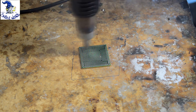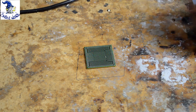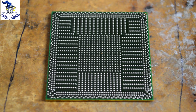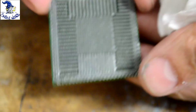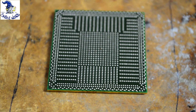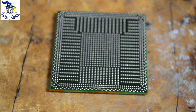The chip is now ready to be soldered back to the mainboard. As you can see, all the solder balls are now attached to the chip, so the chip is now ready to be soldered back to the mainboard. That's leaded solder balls, not unleaded solder balls, so we've taken off the weakness these consoles have with the fact that they have to use unleaded solder.